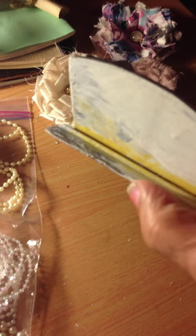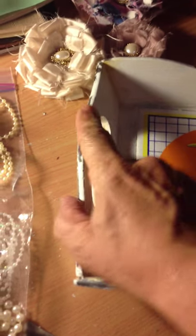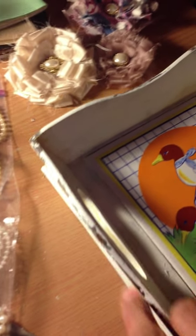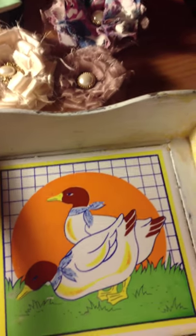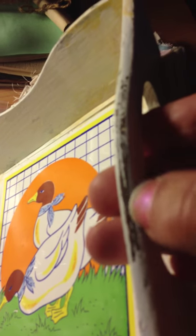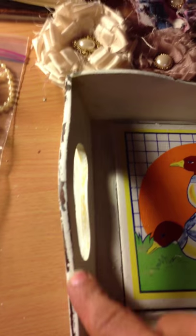You can scrape it with the razor, or you can use a Brillo pad, or you can use a piece of sandpaper. The sandpaper might go a little bit too deep, so you may not want to use it — you might wind up with a whole different color of wood on different sides. I wouldn't use sandpaper for this particular project, because we're trying to be consistent with that dark brown.